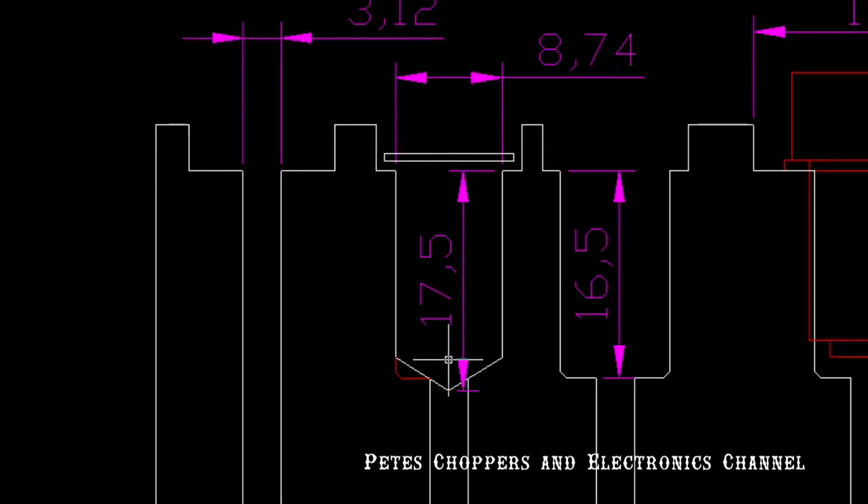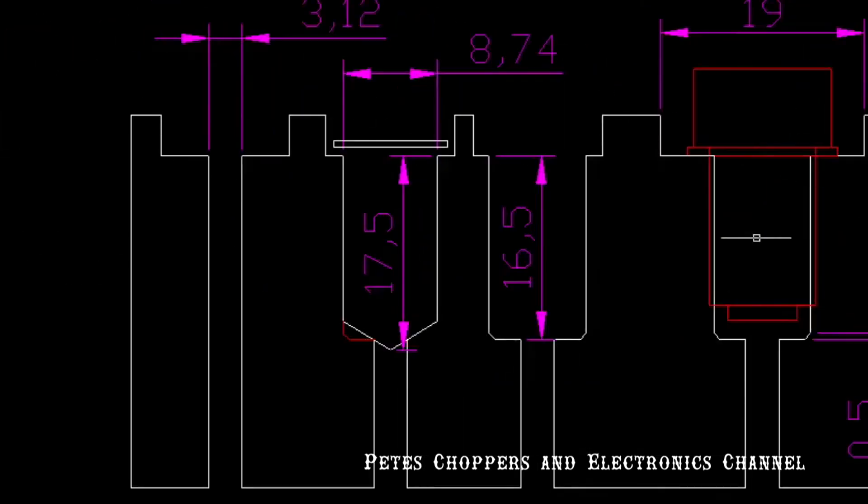The same again with the blunt drill — what I call the blunt drill is a drill used to take out the corner that's left at the bottom. That one has to come down from that surface exactly 16.5mm, and again I'll use the coin to perform that operation. The final result will be a 0.5mm gap at the bottom for the head of the valve to operate in. Don't forget I'm also accounting for the copper washer underneath the head of the decompressor. That explains what the operations are actually achieving.